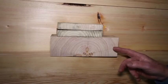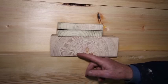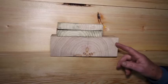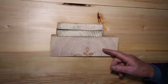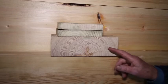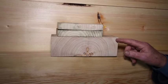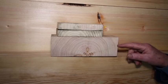When you look at the section through the wood here, you've got the centre of the tree where all the knots are formed, and the inner bit — the first 10 or 15 years of the tree's life — the cell structure of the wood is weaker than in the rest of the tree and is called juvenile wood. Then you've got the period of heartwood, which is usually a little bit darker. The outside bit, which is paler, is called sapwood; it is permeable and perishable, and is a band of about 50mm all the way around the trunk just inside the bark.